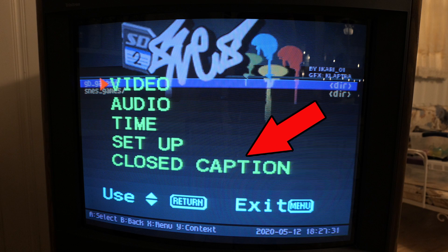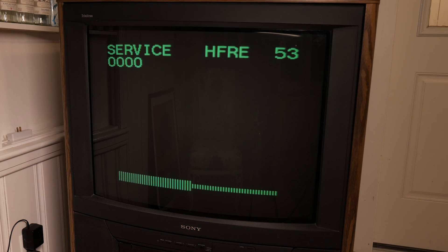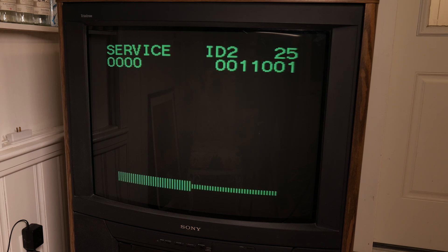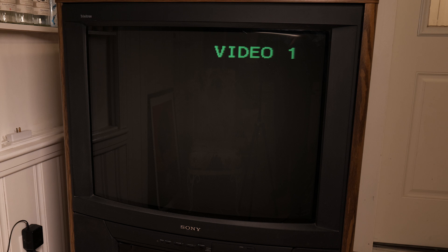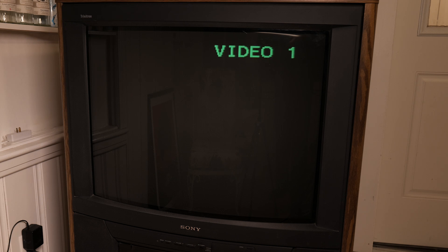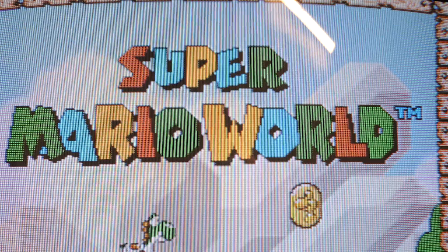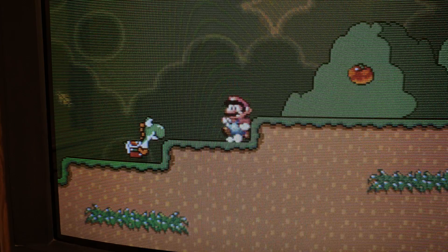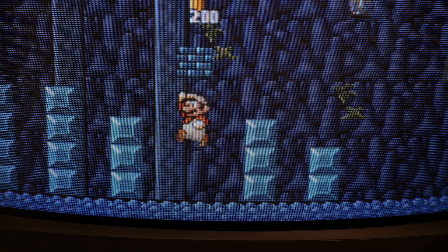Since we disconnected the closed captioning system, I'd like to remove it from the menu, and to do that we'll access the service menu. With the television turned off, I press display, 5, up volume, and then power, and that goes straight into the service menu. Using the 1 and 4 buttons I navigated to the ID2 menu item and changed the value using the 3 and 6 buttons — changed the value from 72 to 8. To save that, I pressed muting and then enter to write it into memory. Now if you restart the TV and go to the regular menu, the closed caption system is gone. I also used the service menu to do some minor geometry fixes. I didn't go too crazy with calibration because I thought it looked good already, and it does look good. I especially like how crisp it looks in the Super Mario World title — sharp, but not too sharp — and the colors aren't as thin as they were with S-video. I have a PVM and sometimes it looks too perfect. This is just right: a vibrant, organic picture.